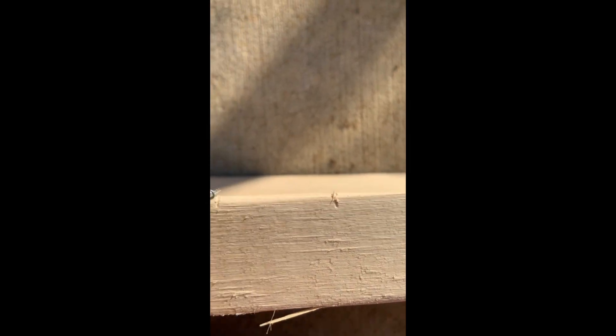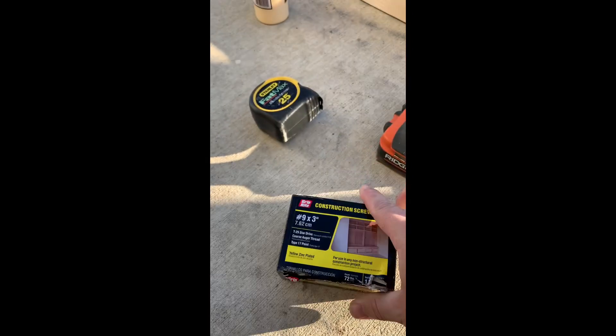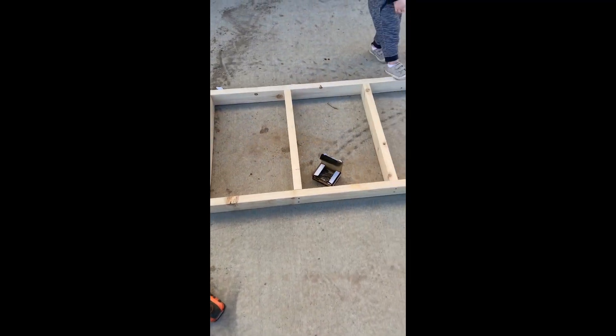A quick tip: when measuring your lines for the little pieces, it's easy to just measure out 17 and a half and make a little mark. I don't have a pencil so I just use a screw to rub a little line. Then measure 35 and a quarter, and from the other side 17 and a half and 35 and a quarter — that's the perfect size for a 2x4 in the middle, so we know our measurements are right. For screws, I'm using number nine three-inch deck screws. You can use pocket holes if you want, but deck screws work fine. And there it is — that's our frame.